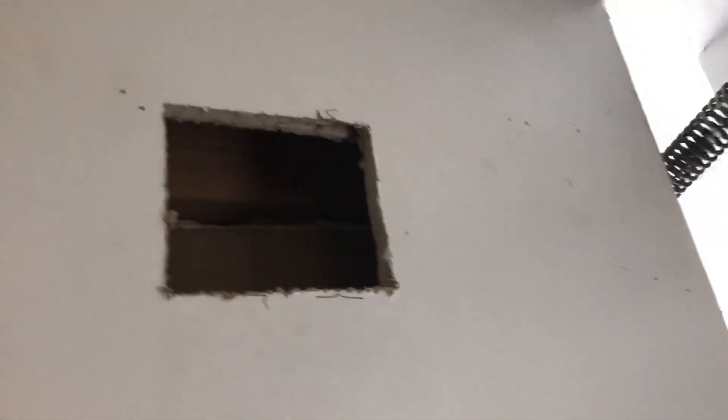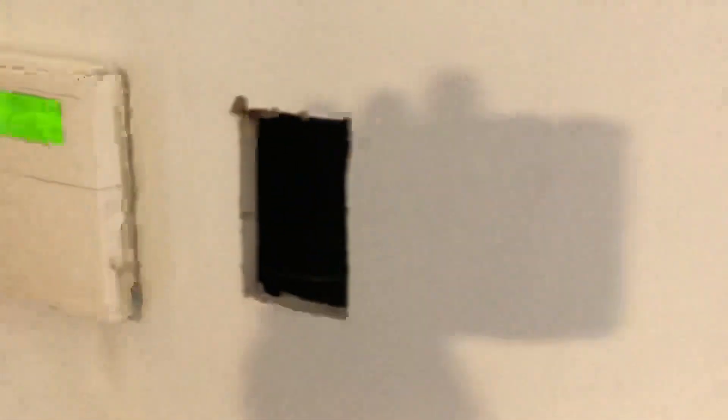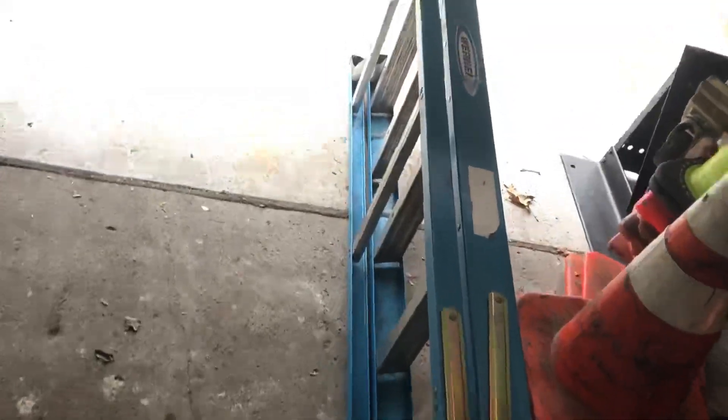Emergency lights are in place — pretty much dead, I haven't had this on in a while. This is going to be another two gang. So for fire alarm, I added a second pull station to the system. This wall is hollow and I kind of need to be able to put my hand in and pull the wire up for the garage door contact. So pull station here, which will be kind of cool, and pull station there as well. I'm planning on using the miniature addressable input modules so that they can fit in the back box.